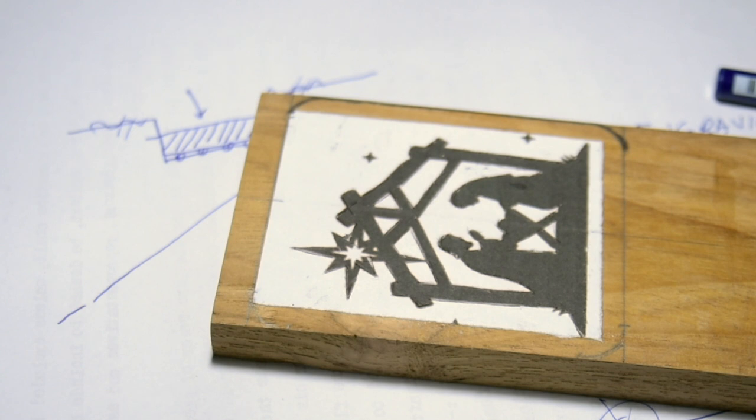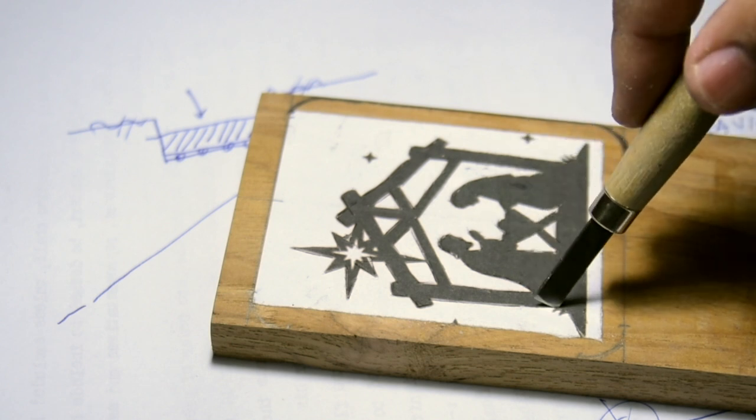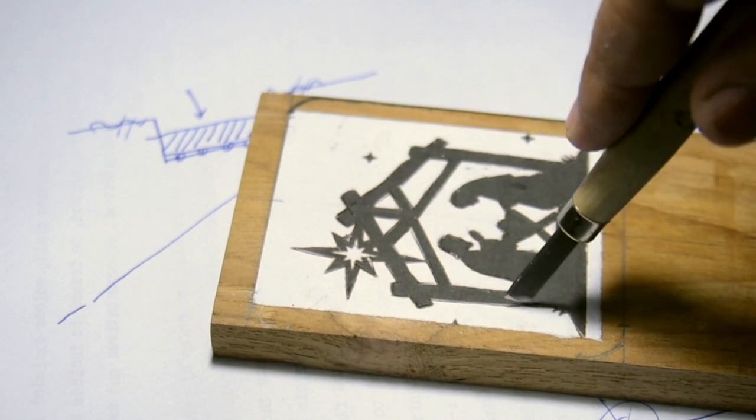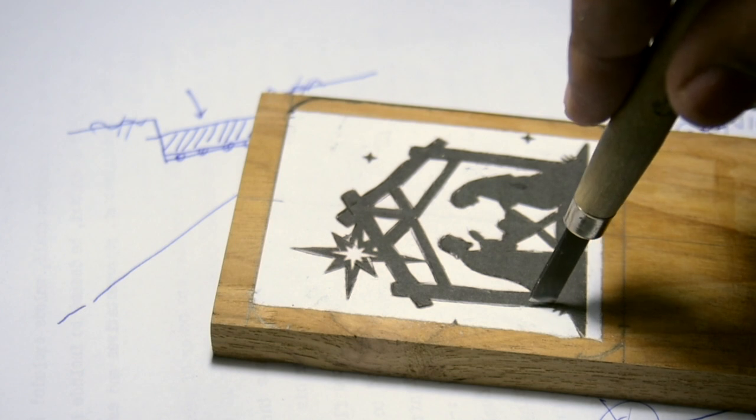If any of you can manage to get a spiral down-cut bit of the desired size, you can definitely use that — it will give you fantastic results. But if you do not have that, it does not mean you cannot do this project. You can use a sharp knife edge or chisel to make your border and then start the cut, so when you reach the edge you reach only to that cut mark which you have already made.